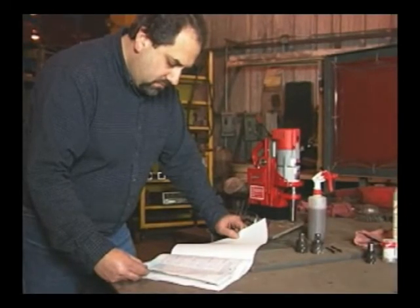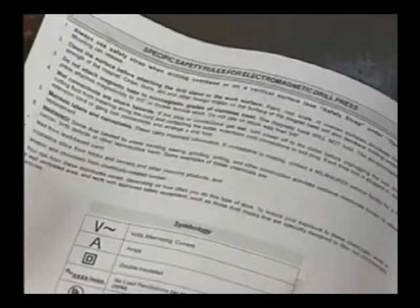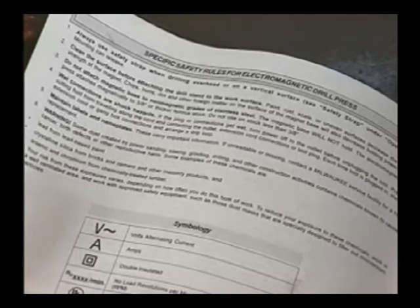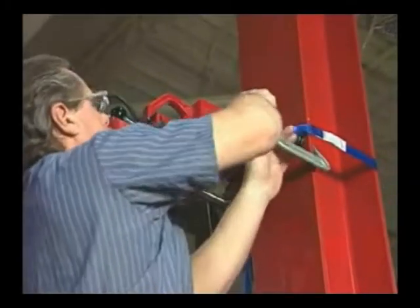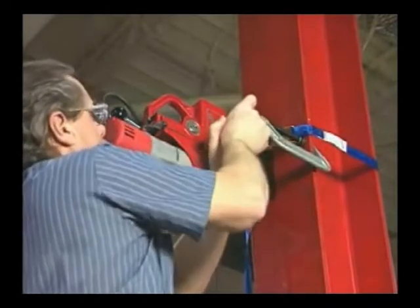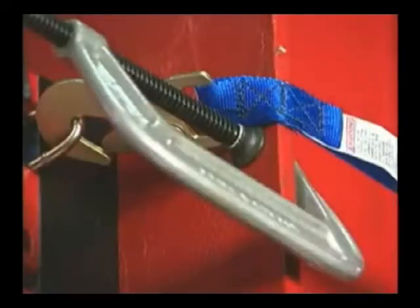Review and follow the safety rules found in your operator's manual. In addition, there are some rules specific to this tool. Power loss demagnetizes the base. For this reason, always use the safety strap for overhead or vertical work. C-clamp the strap to prevent the tool from sliding down.